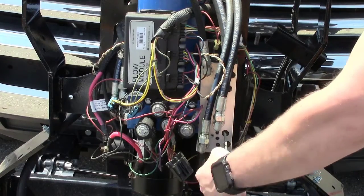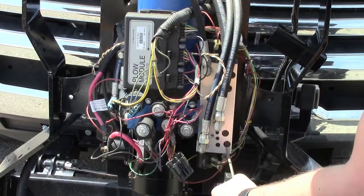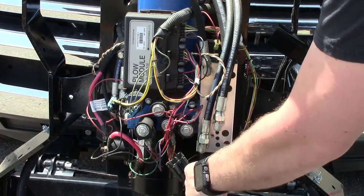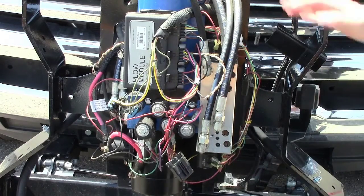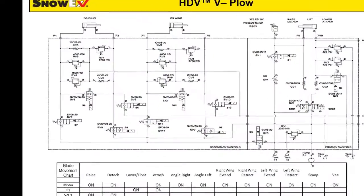This is the default setting for these valves, set at 4,600 PSI. If the plow still won't hold position, it is suggested that the valves be taken out of the block and that you inspect both the valve pieces as well as the inside of the manifold. On the hydraulic flow chart, you'll see how these valves are involved in relieving the pressure on both the driver and passenger sides.